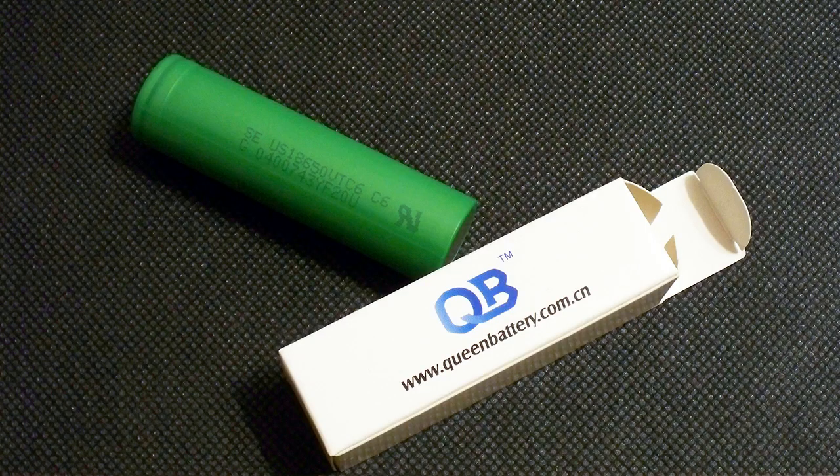At the end of the day, I can say that the Sony VTC6 is a good high-drain cell which performs very well even at 20A. The only strange thing is that Sony uses a 2V discharge cutoff voltage at 0.2C — I think it's for showing a higher capacity rating, but nobody buys a high-drain cell for using it at under 1A current.